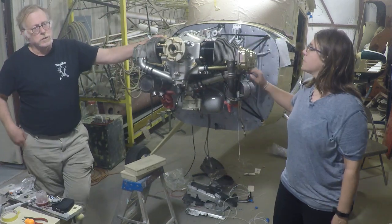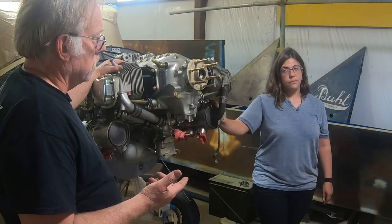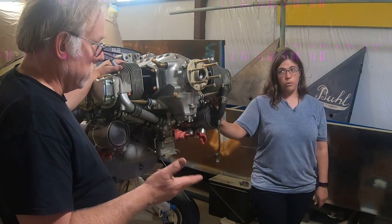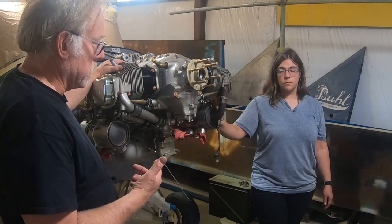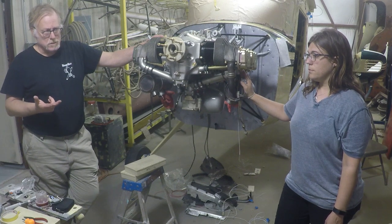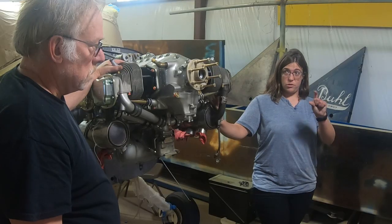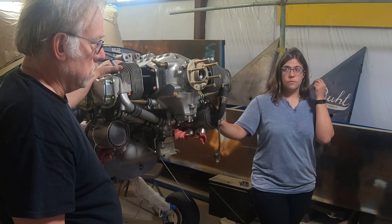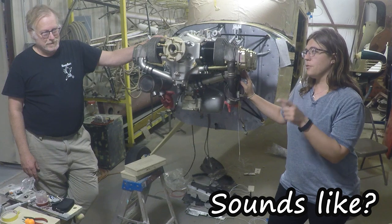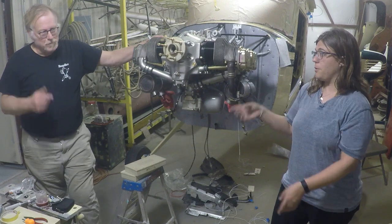The additions you have on this kit are a warning light that goes up to the cockpit, and that's just two wires. There's a field breaker switch, which is going to be new to you if you had a stock airplane. And then it wires through the master switch just like a Cessna. So that's really no difference. The only additional item you would purchase are the rubber snubbers for the shaft that goes in around the input shaft to the alternator.